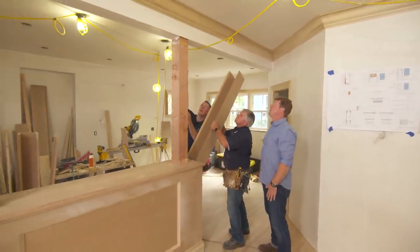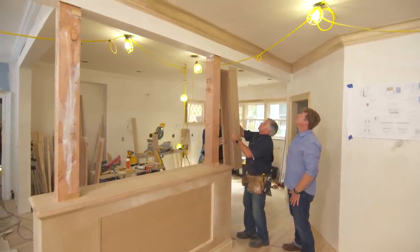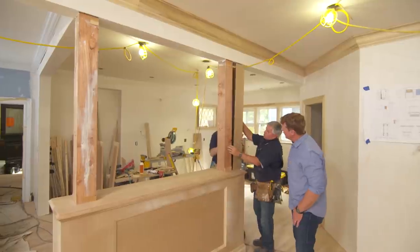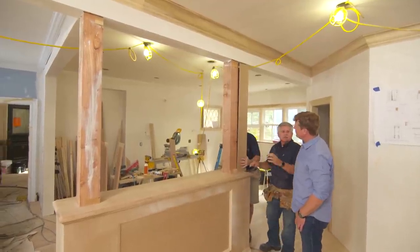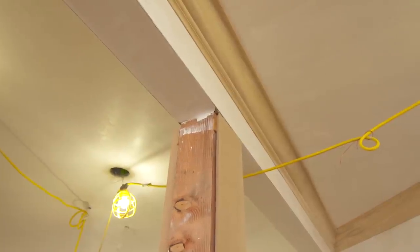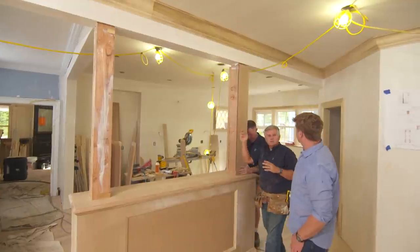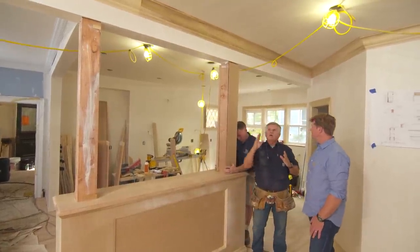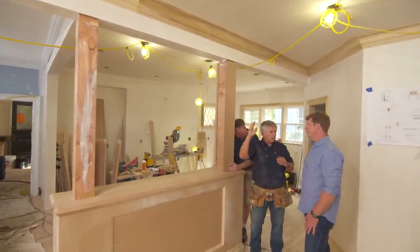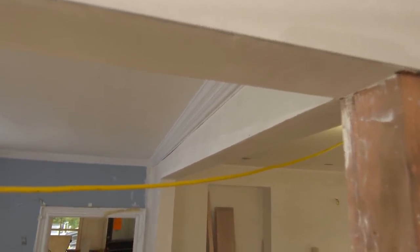And to do that, that meant a bunch of beams. A bunch of beams that, if you look up top, they're plastered right now. And to support those beams, we have these 6x6 fir. Now those beams are actually engineered lumber — they're called LVLs. There's a beam here, a beam there, and another one there. Those beams are actually carrying the second floor outside wall and the roof, and this beam is carrying the interior floor level all the way up to the ceiling.